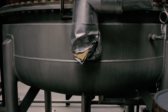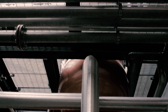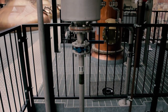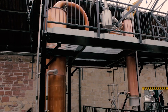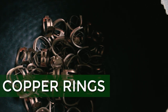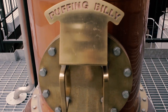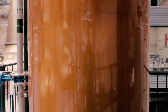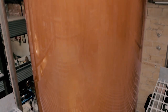This is the Carter Head Still. The Carter brothers were apprentices of the famous Irishman Aeneas Coffey, who invented the Coffey still. What we have here is a hybrid of a pot, an onion, and a column, and then half of the column is surrounded by a water jacket. Within the column you would normally expect to find plates, but instead we use sacrificial copper — specifically designed copper rings packed into the still. We're trying to get maximum copper contact in our still to get the ethanol as clean as possible. This machine was designed with Forsyth specifically to take the new make spirit that comes off the spirit stills. New make spirit that doesn't go into cask to be matured into Scotch will be processed further in the Carter Head still to make our gin and vodka.